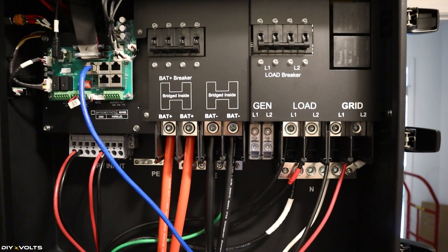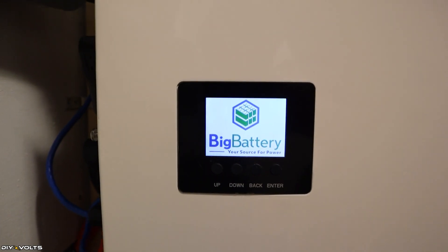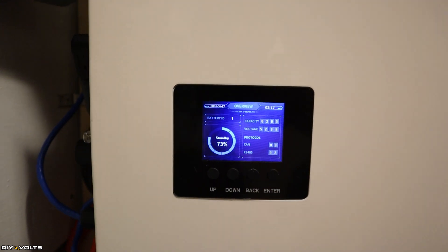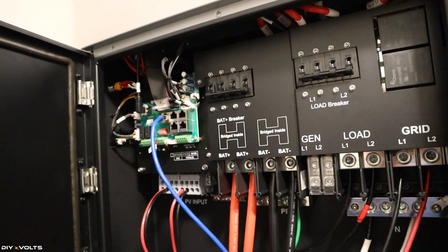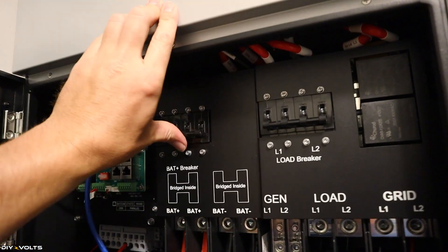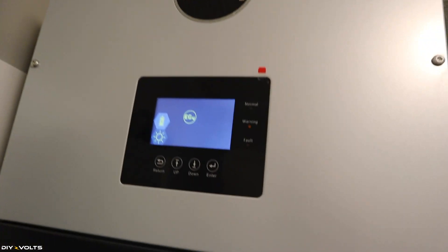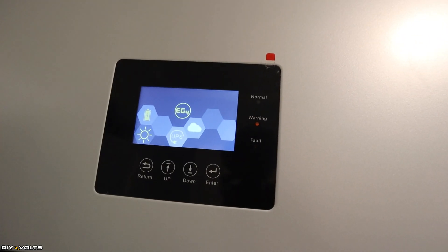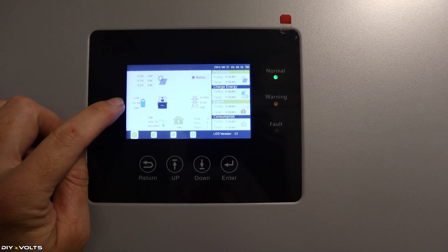Let's go ahead and get things turned on. I have some on buttons on my batteries — I'll click that one and that one. In just a moment we will see the flash screen pop up on the Ethos battery. I've already got the protocol set for the Lux Power inverter that I'm using. First thing is to turn on the breakers to the battery, and we should see some display. There we go — EG4. We'll give this just a moment to load up. 73% on the battery, 52.9 volts — so it is reading the battery as it should.